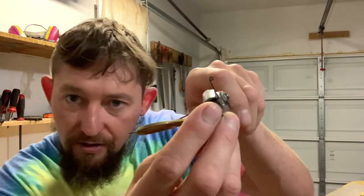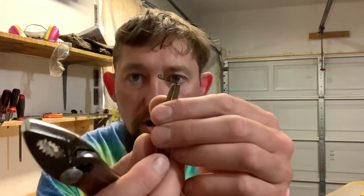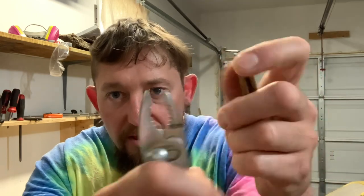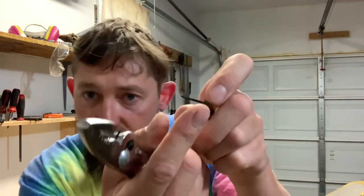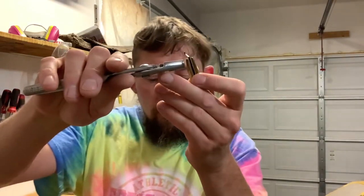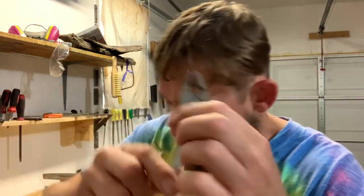I made my own smooth jaw. I took a regular set of pliers and made them smooth for working with triggers, because when I'm working with a jaw harp trigger, I don't want a regular set of pliers that has these rough grippy abrasions. These are made for gripping metal well, but using them on a jaw harp reed, I don't want to cut or scrape or scratch them. So we're going to talk about the process of taking those right off.